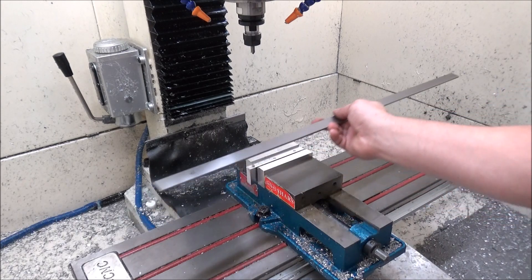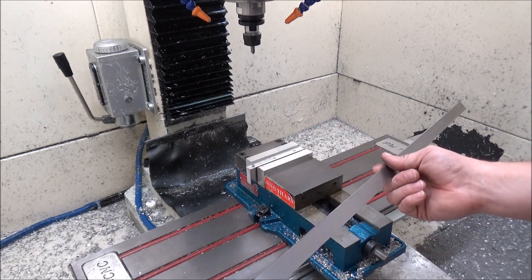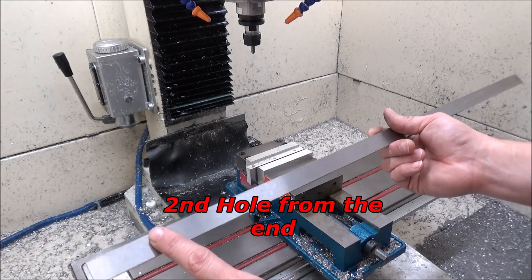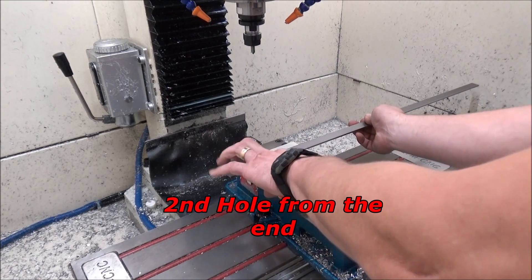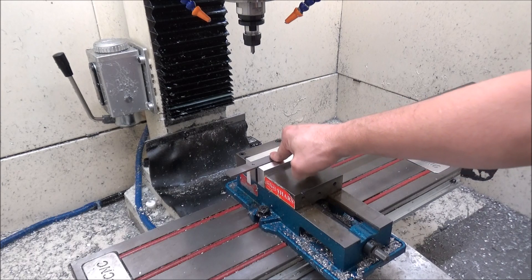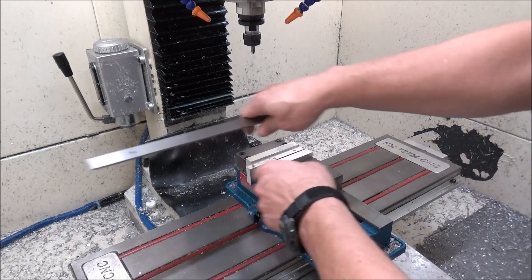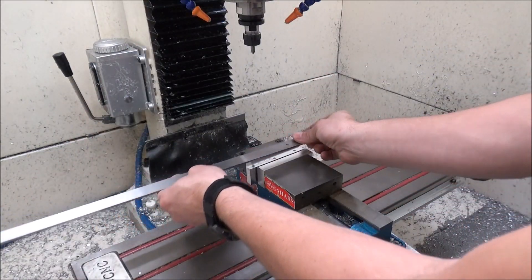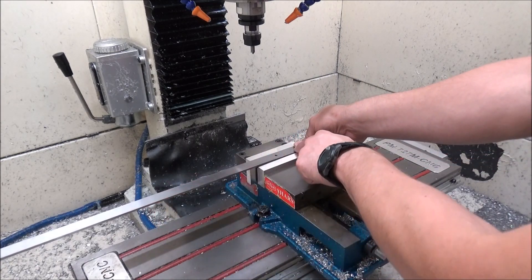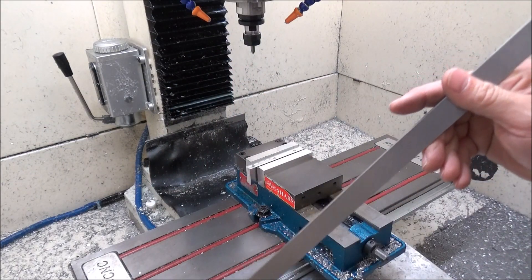So I can't get my first setup - I can't line it up with my mark here. What I've had to do is bore just one hole, one location, the first location, so I can at least get it in my vice. Then I'll be able to bore my first two holes. I have to skip the first one, but when I get to the end I'll flip it around on one of these holes and go back to get that last location.